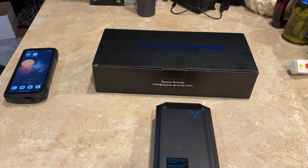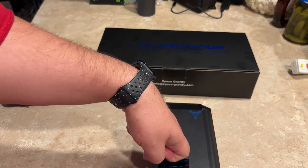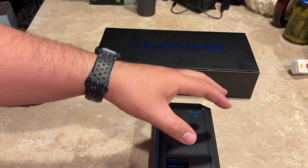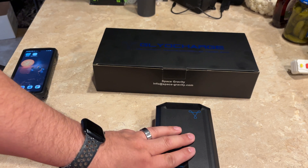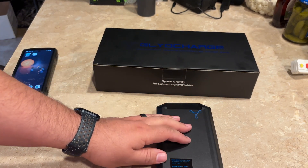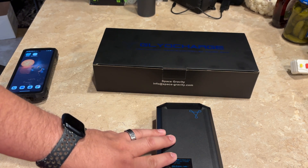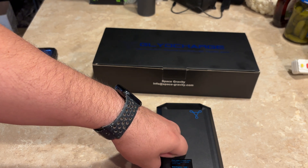Something interesting is it does have a remote, which we'll look at in a second, but first the specifications. This is a 99.84 watt-hour battery — 12.8 volts at 7.8 amp hours — just barely safe for air travel, but it packs solid energy storage. This is lithium iron phosphate, not lithium ion. I really like that because lithium iron phosphate isn't going to self-ignite. You're not going to have those problems where it randomly bursts into flames like lithium ion can. It also has a pretty stable voltage curve even under a heavy load.